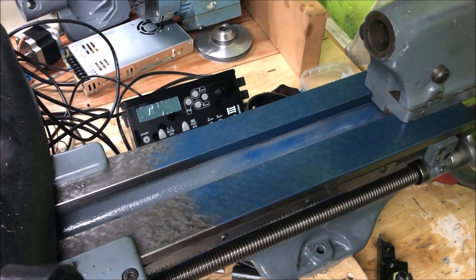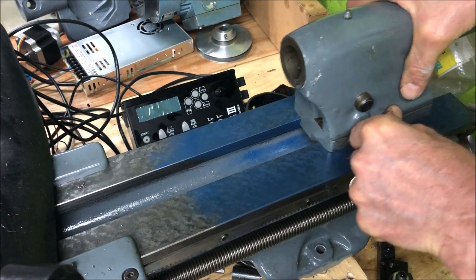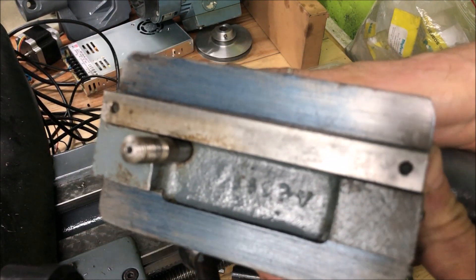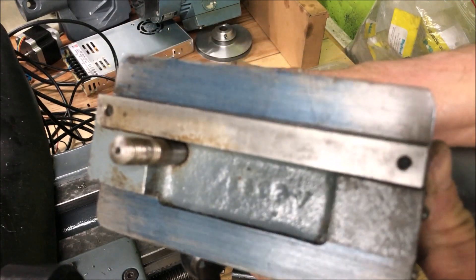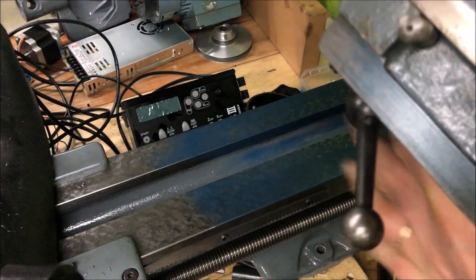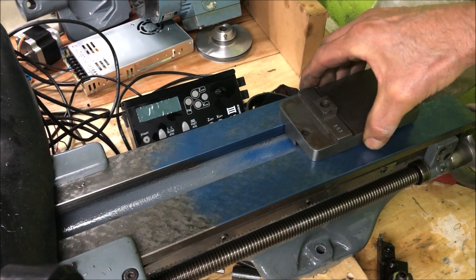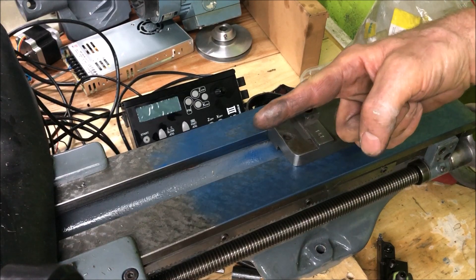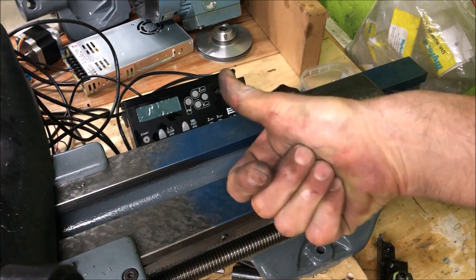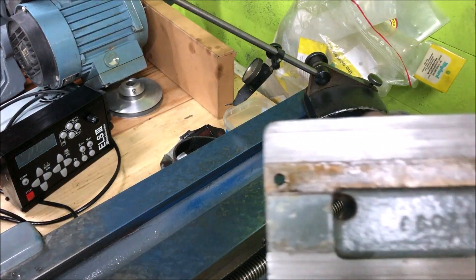And then applying this. Of course, this needs to be adjusted, so both ways. Let's see if this fits better. This is how it can be when ground. And that's probably acceptable, even though I would like to have it a little bit more here and here. But you need to test it anyhow, because that point I wouldn't know before I assembled it — whether the tailstock barrel pointed straight down with the possible deviation in that direction only, not that direction, but only this, and the same up, not down.